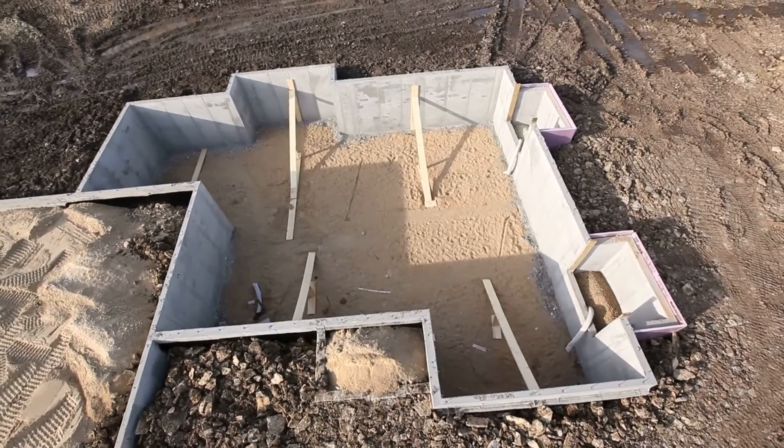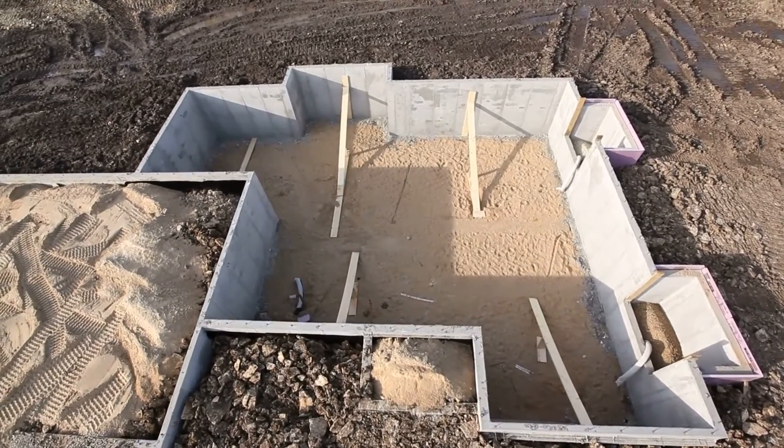You have to allow a way to release — in essence, it's almost like breathing. Two of the most common areas I see hydrostatic pressure are the soils on the outside of the foundation: they've gotten wet, they've expanded, and they're pushing pressure on our block or our poured wall. Or below, water's gathered and now we've trapped it.